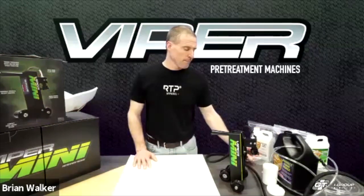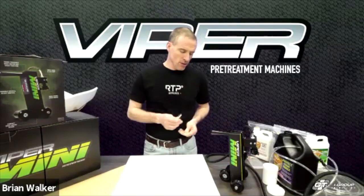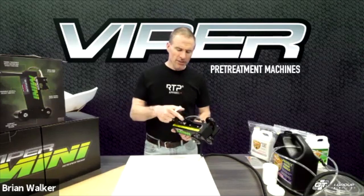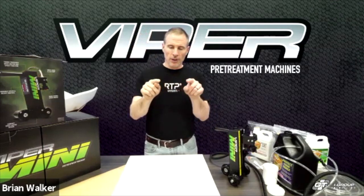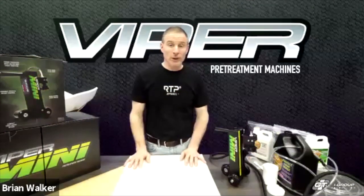That depends. I've seen some really nasty pre-treatment stuff that's hard as a rock and you will never get it clean. But typically most of the time, if it's not too bad, you can just take your spray tip, rinse your toothbrush under some hot water or running water, and just gently brush the surface of the tip. You take the tip out, it's easier to do, and you can run it under hot water while you're doing that. If you hold it up to the light when there's no water in it, you should be able to see a real nice uniform shape to it. If it looks like something's clogged in it, you're going to have issues.